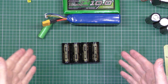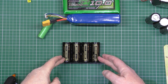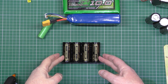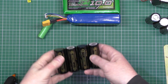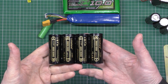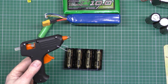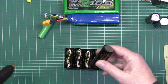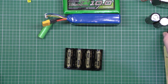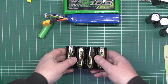I've decided I'm going to make some 5000mAh batteries out of these cells. It'll handle 50A peak or 20A constant, and I know it runs at that. What I've done is glued these together. All you do is get a glue gun, run a slither of glue across it, and then you run positive, negative, positive, negative, positive, negative like that.